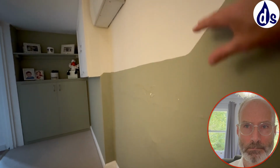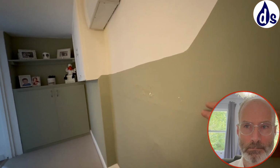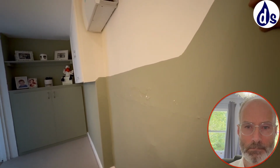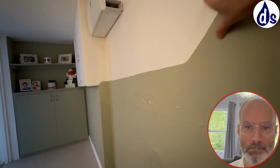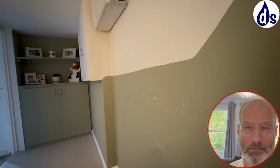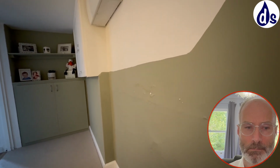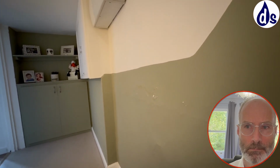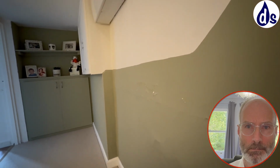Okay. The options here. This is moisture that's percolating down through from the outside. You can do things to improve the outside, like a plinth and so on. That's a sort of raised area of cement-based mortar that goes along. That will reduce the amount of moisture, but you're still below ground, and this building was originally designed for the rainwater that's percolating down through the soil to evaporate through the brickwork, and you wouldn't have particularly noticed it, but it would have been there.